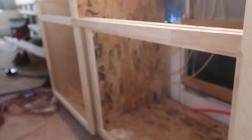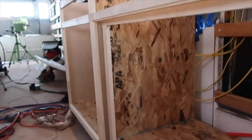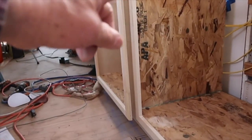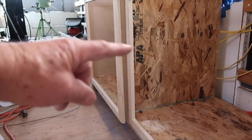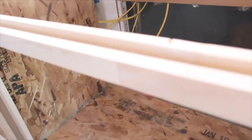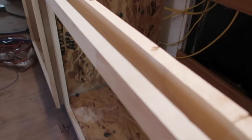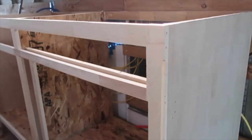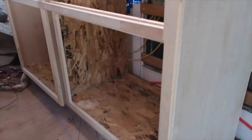I'll just explain it to you real quick. It has an inset face — this is something we used to do a lot on kitchen sink cabinets. It gives a little bit of knee space because of the back set of the inset face. And it also gives very good ventilation — there's like an inch and a half space in between the outside face and the inside face, and that's left open. That way you can just have lots of ventilation.